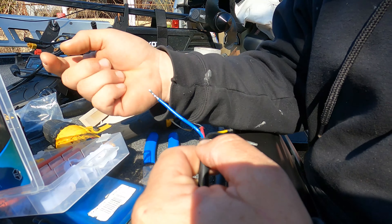Most of the time you're going to have these hooked to a master power switch. I just put the yellow and red together, take a butt connector, put them together, and crimp them down. Then I put a fuse on here — with this one I don't really have to, but most boats you'll need to. If you're hooking straight to a battery, you put a 3-amp fuse in and connect that to your power wire. You have to put that yellow and red wire together or the box will not turn on.